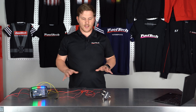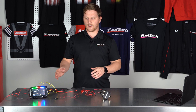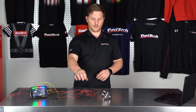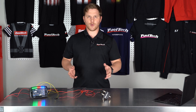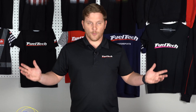There you have it — both configurations you can use for wastegate boost control solenoids: power activated or ground activated from our outputs. A lot of people like to use the yellows because it shortens your wiring — you basically have two yellow outputs run out to the red wires, the black wires tied together and grounded to your chassis, and you don't need a separate relay or anything to turn power on. That makes the install a lot easier. But if you have a boost arm switch or you've used all your yellow outputs and want to use a blue output with ground activation, you can do that too with the configuration we just showed.